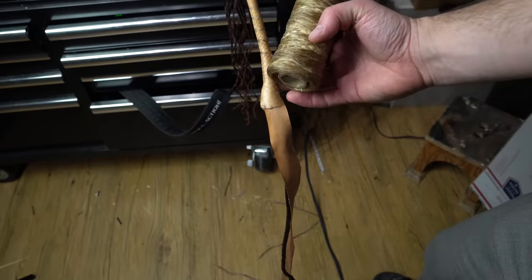Now real quick before we get this blade in here, I wanna give you guys a little tip. Because cutting leather tends to dull these blades so quickly, what I like to do is take a permanent marker and mark both sides of the blade, so that when we stick it in the strander, we have the luxury of being able to adjust at what position the blade is cutting. It can slide this way, so if this part gets a little too dull, we just move it a little bit. That mark on there, which I just apparently rubbed off, I thought this was a permanent marker, you'll see a wear mark. And that's how you know where you've already been. You can get the most out of your blades.